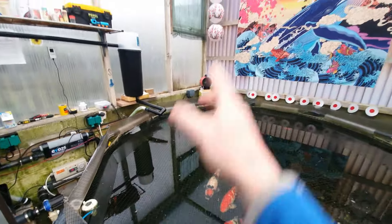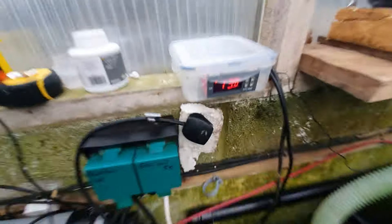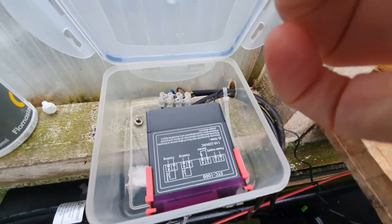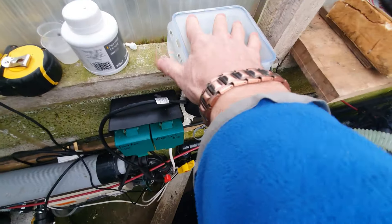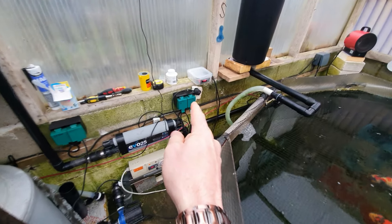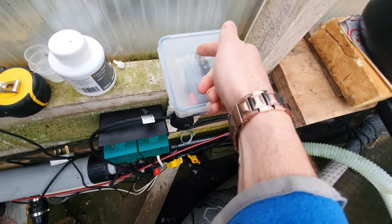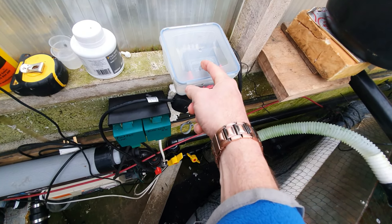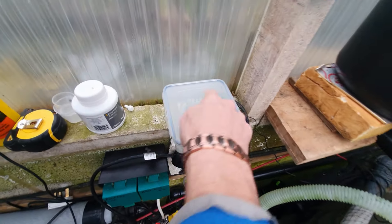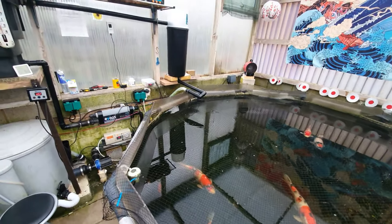I've been in contact with a few people who've bought mini air source heat pumps and what they do is buy the STC-1000 controller and put it in a little sandwich box so it's sealed. Basically the power goes in to operate the unit, there's a link that goes back into the unit, and this STC-1000 switches over. I can have it set on 12, 9, 5 — whatever I want — and it sends power back out to the air source heat pump. The air source heat pump turns on with a 3-minute delay and then kicks in and runs.